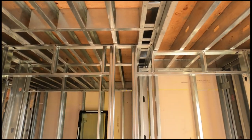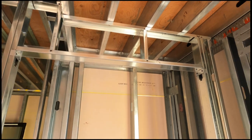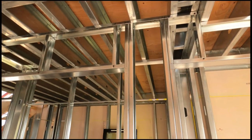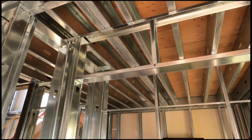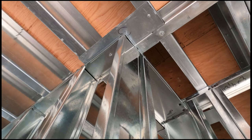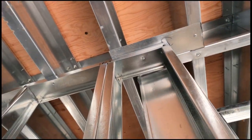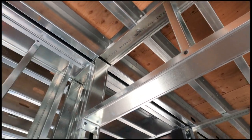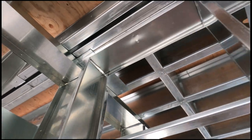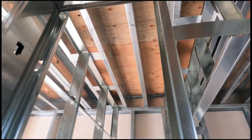You can see where there are different elevations in the ceiling — you can't necessarily plot that out on the bottom track. You just measure up there and fit the pieces in. You can see where I'm overlapping my tracks and tying things in to make it super strong. Use clips wherever you feel is necessary. Sometimes the top track lands a little bit on the joist but there's just not enough meat, so you add a clip to stiffen it right up.